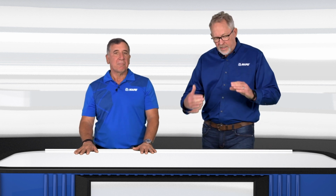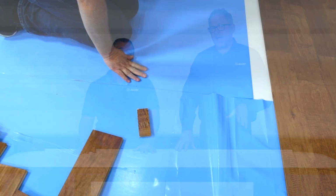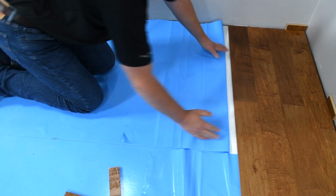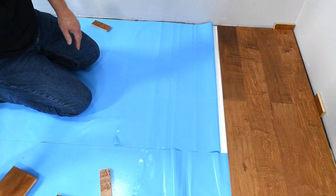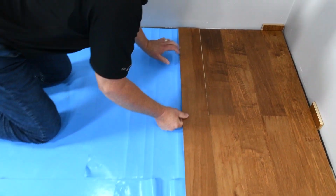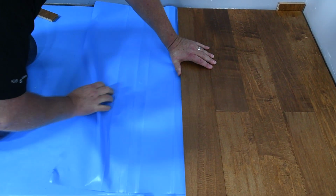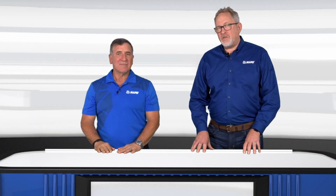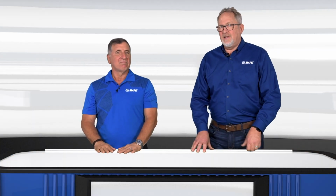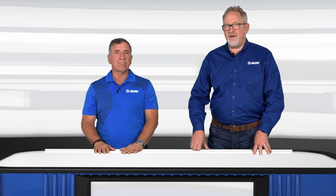Installing wood flooring or anything with a tongue and groove type of assembly requires a little different installation practice. In this case, you would fold back the release liner, assemble the flooring on top, and then pull the release liner out from underneath. Kind of like pulling the tablecloth out from underneath the china. That didn't work last time I tried it. It takes a bit of a learning curve, but once you get the hang of it, you can go pretty fast. We have an installation video online. Check out the link in the description below this video.